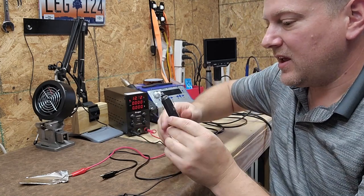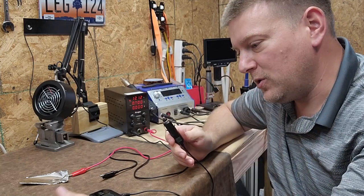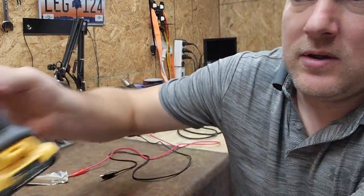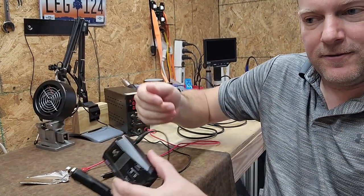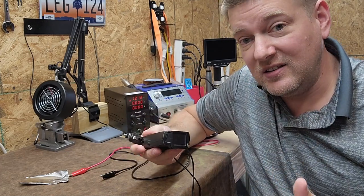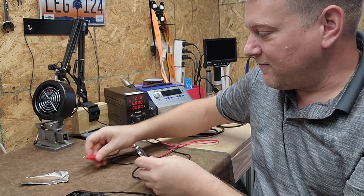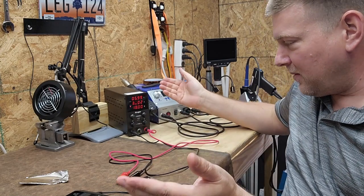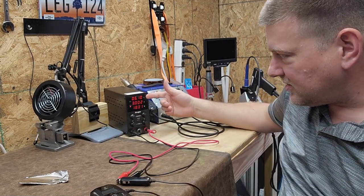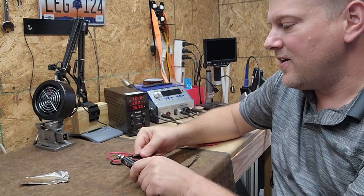It's possible I also popped a fuse inside the device itself. The fuse inside the 12-volt adapter was your first fuse. Almost every single device that has a battery has internal fuses — almost every single one. Unregulated DC is one of the most dangerous things out there; it can start fires almost instantly. After readjusting the foil, I do have current draw — I'm running a full 3 amps. The voltage dropped to 6 volts, sucking 3 amps — 18 watts. Something is probably shorted.